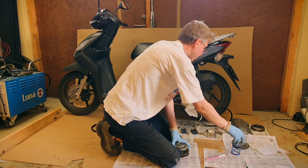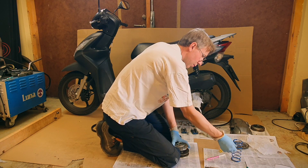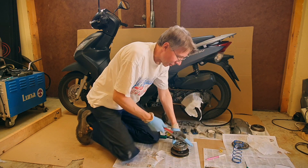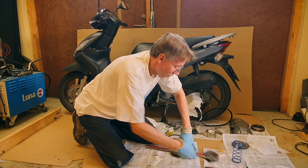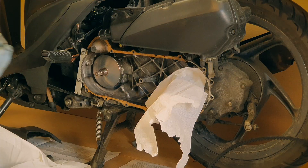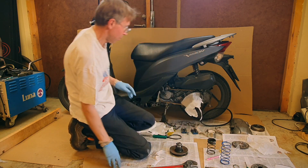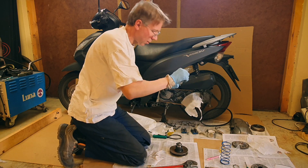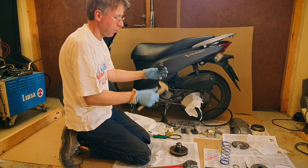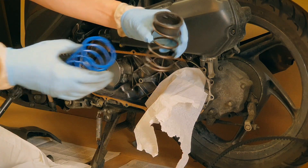I also checked the spring. The spring is at least half a millimeter smaller in diameter — that one is 4mm and this one is bigger, at least. So let's see now — I'll use this one. Now will this come flying in my face or not? Small thin nut. Just out of curiosity I will measure. This spring is not much bigger than 4mm but it's bigger — about 4.25mm maybe. But it's also way shorter, so this is a much stiffer spring, for sure.